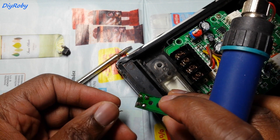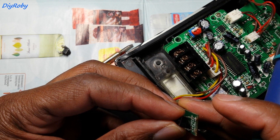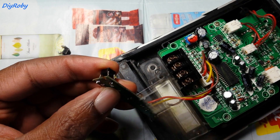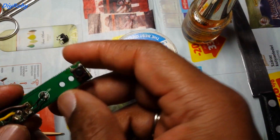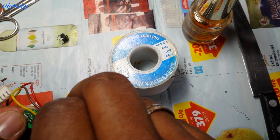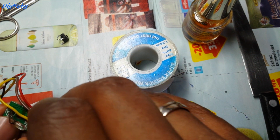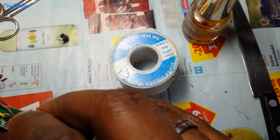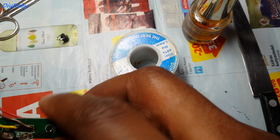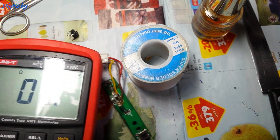The same thing goes for putting the new switch back on. All those holes were fully plugged with cold solder and it took me over 20 minutes to get those legs back inside. Now it's done — I've soldered and cleaned up the water damage section. I cut off the damaged cable end and stripped a fresh section of insulation so I have a clean, unburnt section to solder back to the board.